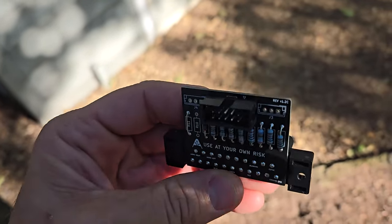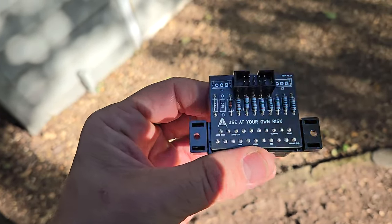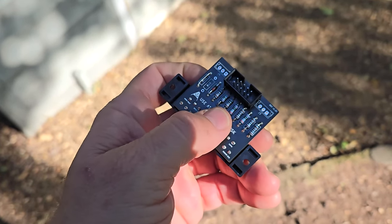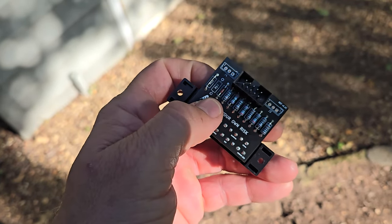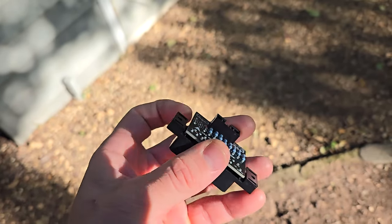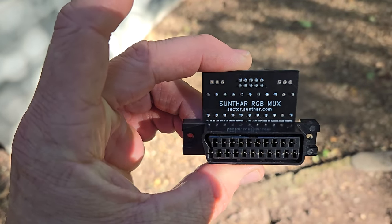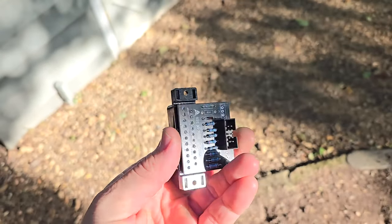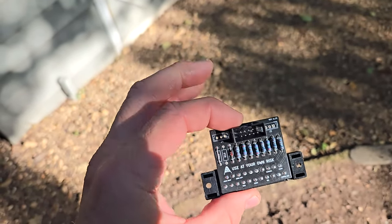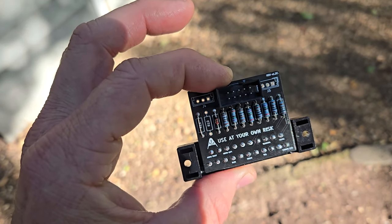It's, what does it say, version 1.2C. The SCART input soldered in, and then this is the specific build out of resistors, diode, and this is actually just a bridge on R11 there. So that's all custom made based on the information on the MUX mod itself, and that's available with the guide I showed you. So all I need to do is plug this in to our circuit board, put it all back together in the TV, and let's see if we have RGB.